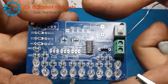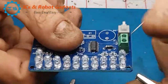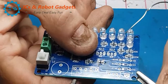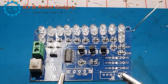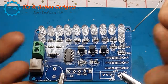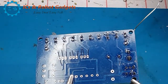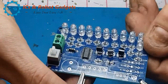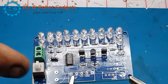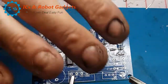As you can see on the shape of the board, almost circular with a flat edge, that matches up with the three-sided shape of the transistor with the flat edge. So that's the three transistors in. There is a fourth, but we'll have far more fun with that later. They're going to sit in place quite happily. Bung that over. This bit we're saving to last, but we'll actually do the speaker last. We're going to save ourselves the space between this resistor and this speaker to work with.